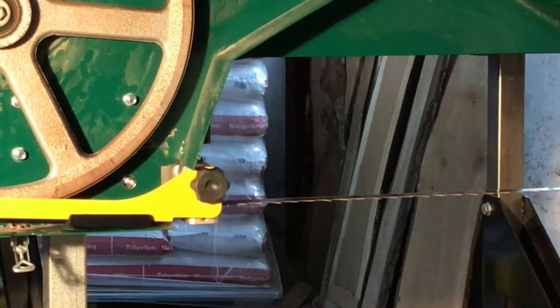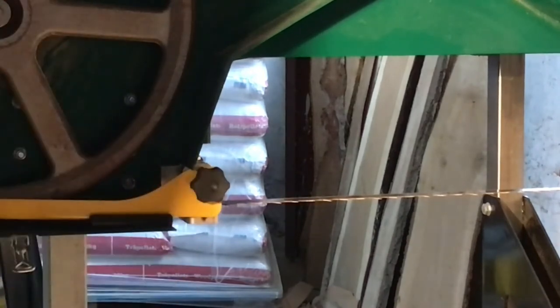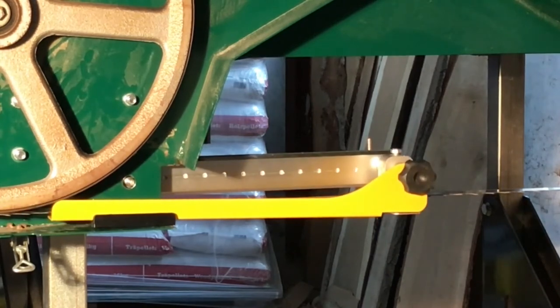You can see I made a quick test here to see if it was possible to pull it forth and back and see how much it got off the track. And again, I measured how long it should be, the distance from the side and into the block, and the measurement was about 15 millimeters. I used quite some time to be 100% sure where to put it. I know from the videos I saw of the 2020 sawmill, the block is almost beneath the center of the wheel, so it has been pushed a little longer in.